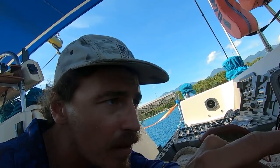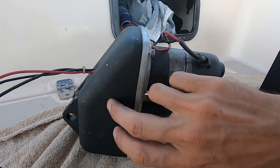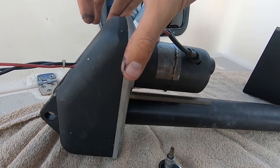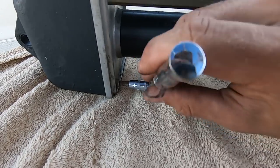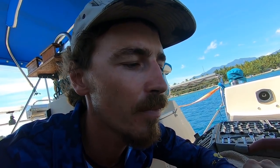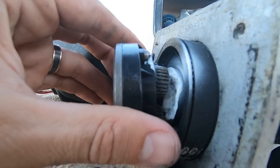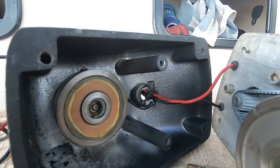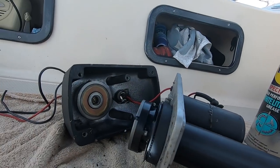I've taken this electric motor apart before and cleaned out the brushes — everything seems good. I'm going to take it apart a bit further. There should be planetary gears and a belt on this side. The older models have plastic gears, which is what usually fails; I'm not sure if this one has brass or plastic. I sprayed some grease on the planetary gears and reassembled for testing. It's a simple system: the electric motor turns a planetary gear set, turning a thread inside the cylinder, forcing the rod to move in and out to steer the boat.